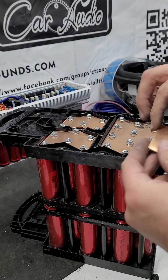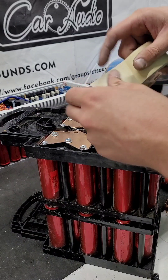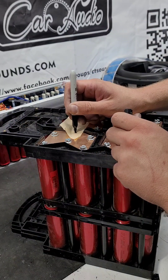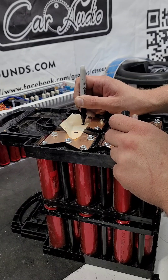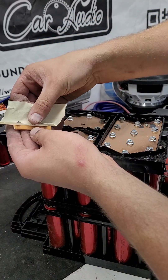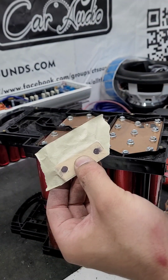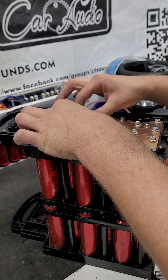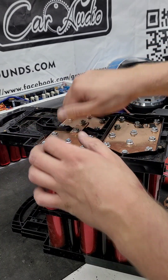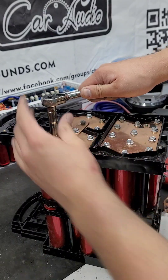So this is that piece after I've cut it. All I have to do is drill two holes in there and then bolt it down. I learned this trick on TikTok — basically you take a piece of tape, lay it across your holes, take your marker, and mark out your holes. Then when you peel it off, stick it on your copper bar — you can see right through there, just like that. Now we're going to drill those holes out quarter inch and it should be ready to bolt on. Drop it on there — absolutely perfect. If you're using just this little one you can use the same bolts, but when you put some bigger stuff on there you'll need longer bolts. Now go around and tighten every single bolt on the whole unit.